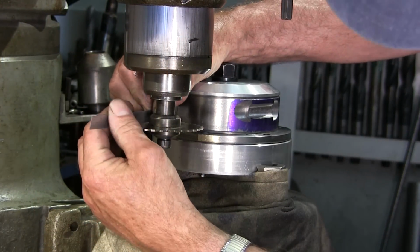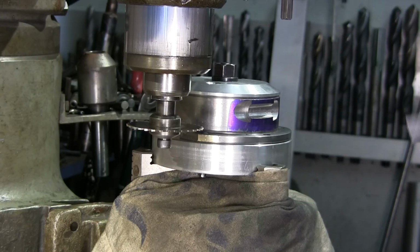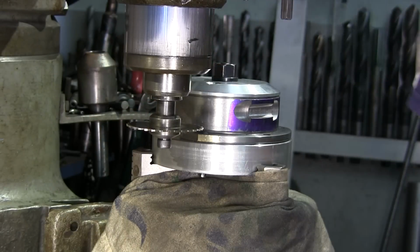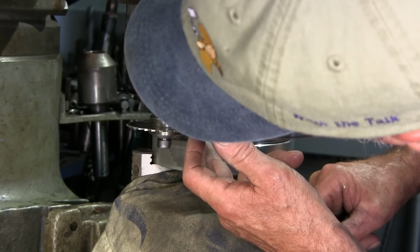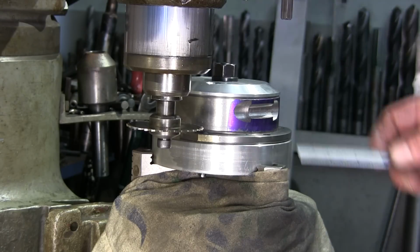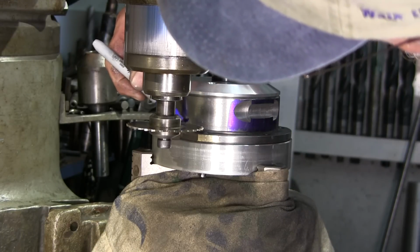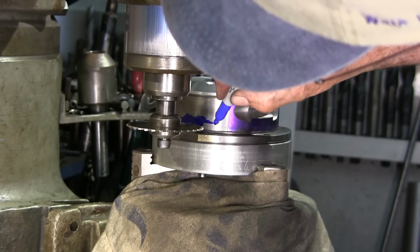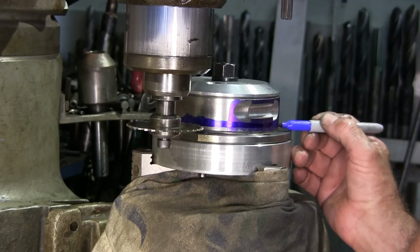All right, I think we're just about ready to go. Taking a straight edge and going across the top, I'm just under the top of the 3/32 radius. If I lay this flat going the other direction, actually let me get one of my firmer scales here. If we take this one, we're just as far above the bottom of the radius on the hole, so it looks center to me. I'm going to put a little sharpie along this edge that I'm going to be cutting all the way over to the other hole.